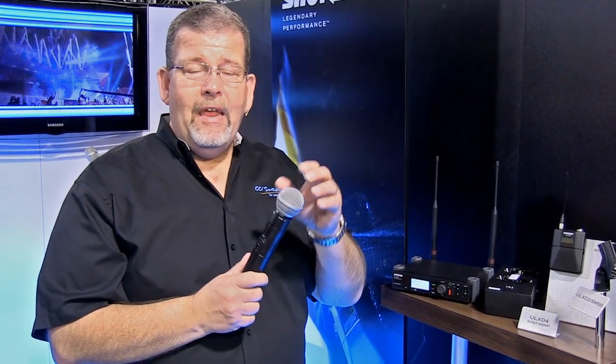The other thing that's really fascinating about this: if you've ever operated wireless microphones, you know that you give the wireless microphone to the talent, they start singing, and sometimes it's really loud, and you've got to run up, take the microphone apart, and adjust the trim control. The new ULX-D has an automatic range sensor in it, so it will adjust the input trim of the microphone so it will not clip. It tells the receiver when it's changing the range, so the receiver also adjusts the other way to keep your volume the same. You don't even hear that — so no more clipping the microphone.